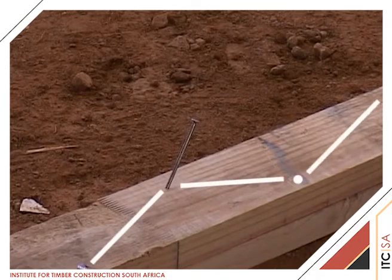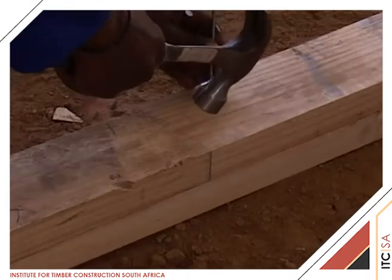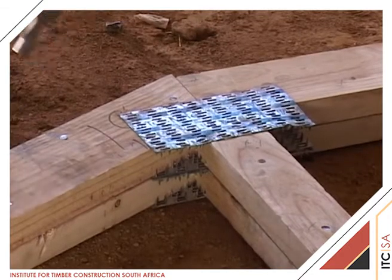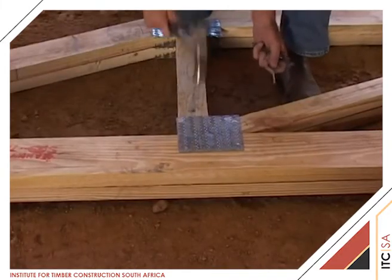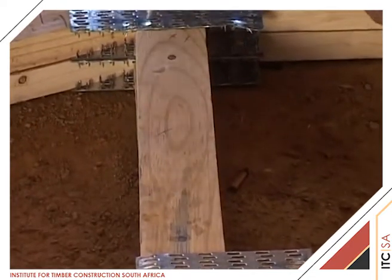The rule of thumb gauge used on site for measuring the distance between nails on the angle is by stretching the thumb and little finger from one nail to the position of the next. This method results in a fairly accurate horizontal line for 150mm centres of the nails. The nails are fixed into the centre line of the webs at 300mm centres.